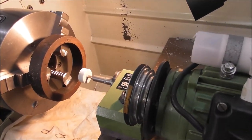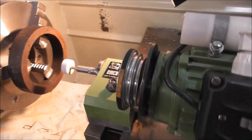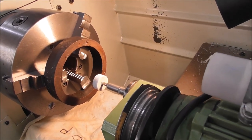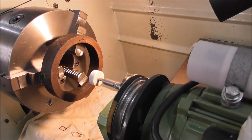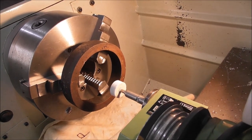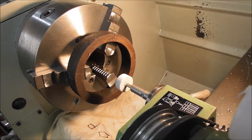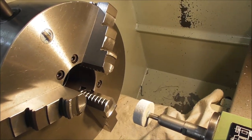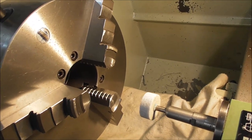One of the standard cures for inaccuracy caused by jaws slopping around is to set up a tool post grinder in your lathe, lock up the jaws on a ring, and grind the inside of the jaws. That way you theoretically generate a very accurate concentric axially-aligned inside edge on your jaws. I learned this many years ago, but I wasn't happy with it — because when you grip on the jaws with a ring like that and tighten the jaws outward, you're actually racking the jaws the wrong way, so that they close in at the toe, which means when you've ground them you've bell-mouthed the jaws.